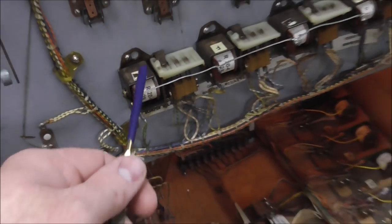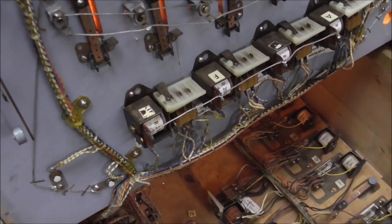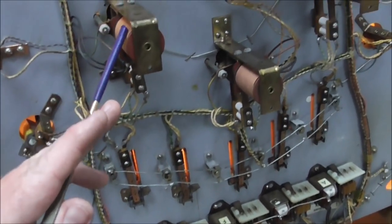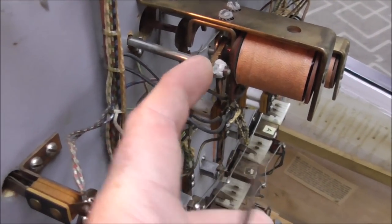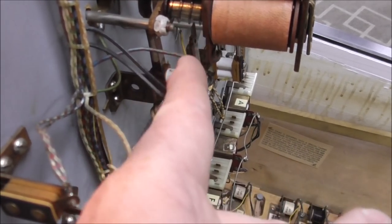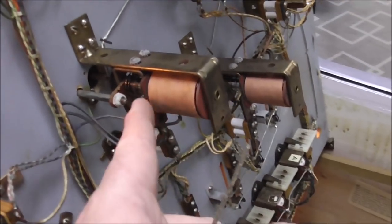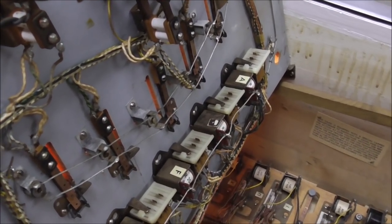So there's a relay down here. That is the purple pop bumper relay. Alright. The relay is making its score, and it's making the coil come in. When the coil comes in, it pulls this down, which on the top knocks the ball off of the skirt, which, since the ball's off the skirt, that switch is no longer connected. And this switch here opens up when it's all the way down and kills the power to the relay, which kills the power to the coil. What a clever way to do it, right?